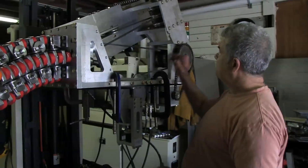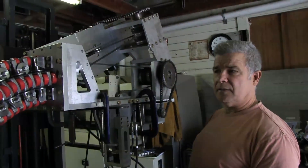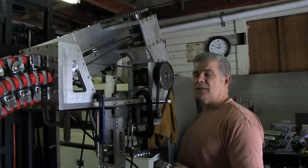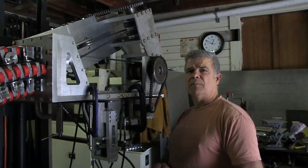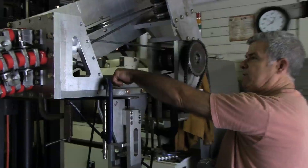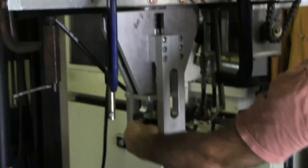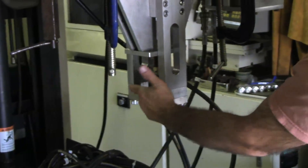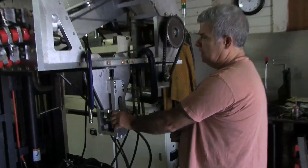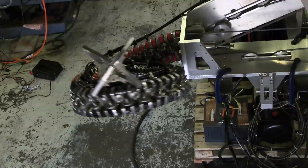What I've done is decided to make a push-pull winch. It's a pretty unusual way — it's a common way of moving long distances precisely, but you really don't see it much out of the oil or mining industries. You can see right now the cable is running through a tensioner on one side, and the tension on that cable is controlled by the spring.